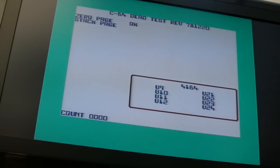I mean, the reality is with that, obviously I need to clean up the old 257s and test those. But it might be that that resistor, well, we know that resistor will have been levered off, shattered in two, just by the RAM removal. So was there ever actually a fault with the things that are left on this board? I don't know. We've got a CIA thing down there, obviously there's one missing at the moment, that's going to be the first issue there, but we don't know about the other CIA that's already on board.